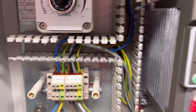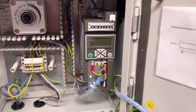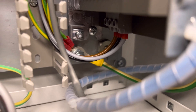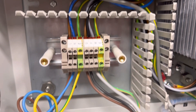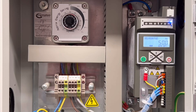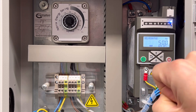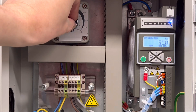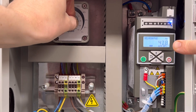Following the wiring around inside the panel, you can see here the inverter, which takes the single or three phase supply and changes it to a three phase output, but with one crucial difference. Because of the inverter, we can now change the frequency of the supply, which allows us to control the speed of the motor. And if you're worried about accessing complicated menu levels within the inverter and programming the frequency in, all you've got to do is just turn this dial, which is connected to a potentiometer, and this will signal to the inverter to change the frequency and thus the speed.